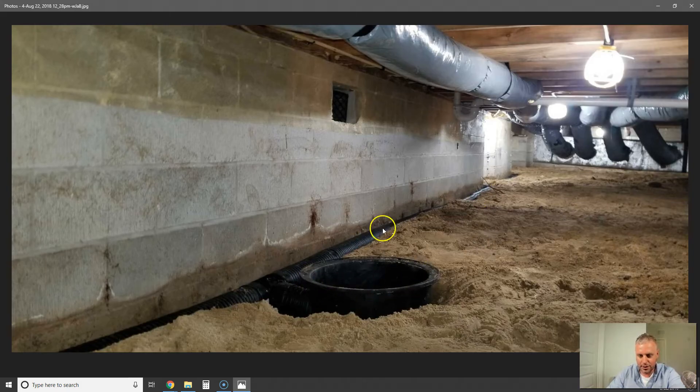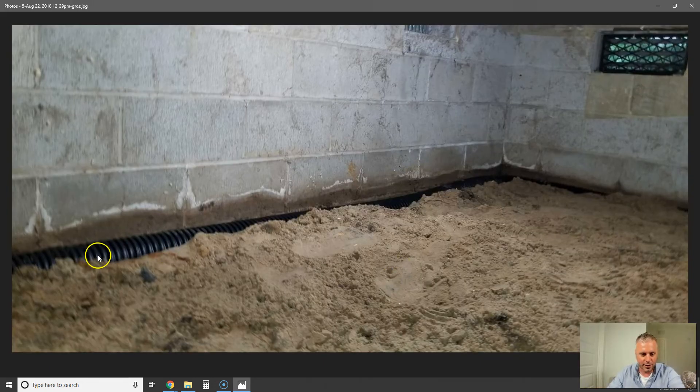Here's the basin — you have the pipe coming inside the basin, and it's cut. The pipe goes into the basin so it's not obstructed and water can easily flow right in. Then the sump pump will be installed there to take it out. A lot of companies are terminating the pipe early without connecting it into the basin — it will not reach the pump fast enough and you'll have a failure, flooding your crawl space again. Make sure this pipe gets tied all the way through the sump pump basin.